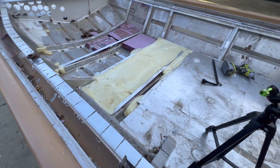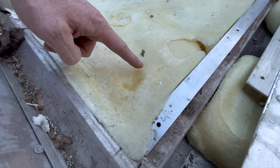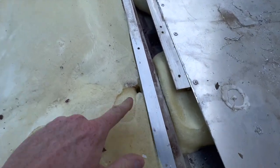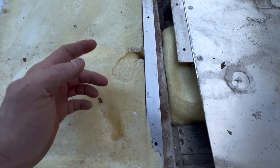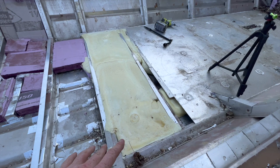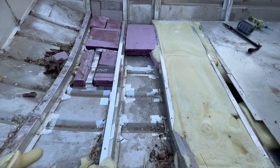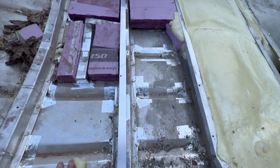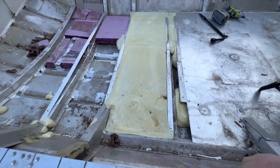We got the first sheet off, and this is the reason why I want to completely rebuild this boat. Right here we've got a little puddle of water that has nowhere else to go except down into this crack — and there's water down in there too. More foam closes all that off, which means that water's not going anywhere. In Project Wilson, after putting in the pour foam, I took everything back out and used only the pink foam — you can see up in here everything's dry, no issues. That's the reason why we don't put pour foam in a flat bottom or mod V style boat; only in deep V's where you can make that center channel and have everything draining properly.